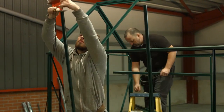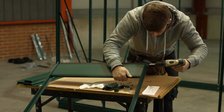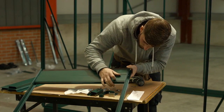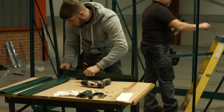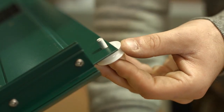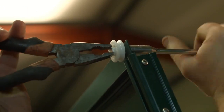Insert glazing beading into the inside channel of both glazing bars. The lower infill panel interlocks with the bottom door panel. Fix the door together by screwing the self-tapping screws through the glazing bar, then in turn into the self-tapping screw groove in each door panel — a manual screwdriver or electric is acceptable. Fix the door wheels into place by pushing the long bolt provided through the centre of the wheel, then through the hole in the top panel from underneath. Make sure the collar of the wheel is pressed up against the top panel. Add the washer and locking wheel nut to the bolt and tighten.